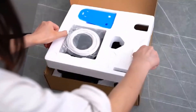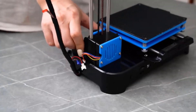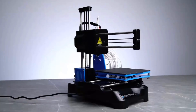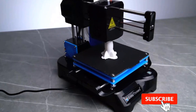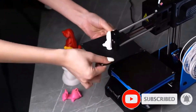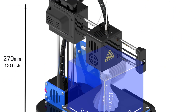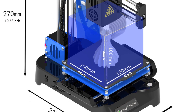The Mini 3D printer DIY kit consists of two main parts and can usually be assembled in just five minutes following the assembly video. The filament holder can point inwards or outwards without affecting use. The printer is equipped with the latest extruder technology, which rarely causes nozzle clogging or poor extrusion. The nozzle is a professional all-metal 0.4mm nozzle that reaches operating temperature of 180°C in about three minutes.